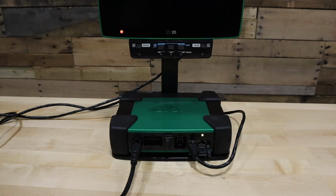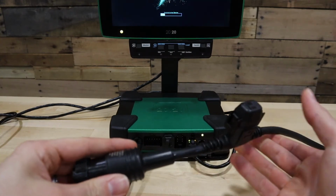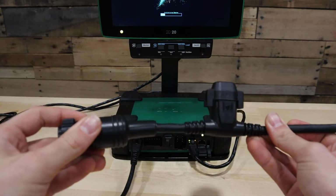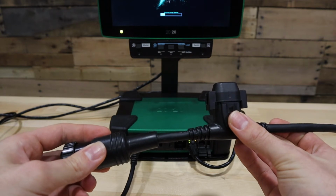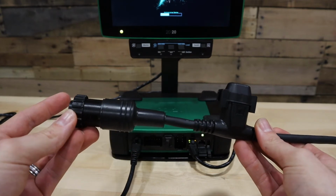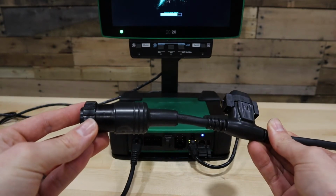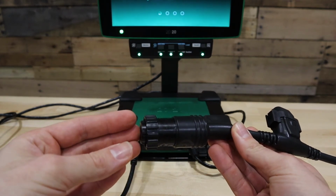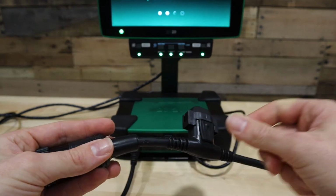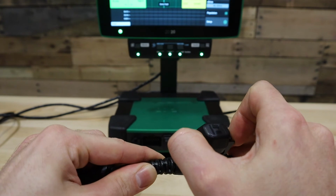Once we verify that the DBM is connected to power, trace the power harness coming from the DBM until you find the connection going into the cab of your tractor, and also a fuse holder that we can check next. Verify that the convenience port outlet connection is plugged into the convenience outlet or is connected to an adapter if an adapter is needed. Next, open the fuse holder cap to check the fuses out.